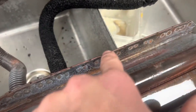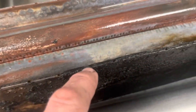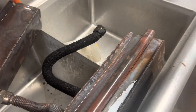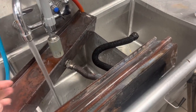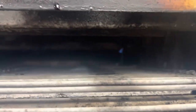Air gets infused — you've got gas coming in the upper rail right here, and then you have the circulation fan that blows the oxygen in to combust. Look — closed, closed, closed, closed, closed, closed. So you're not getting much oxygen pumped into this side, which does explain why they said the right side of this unit does not cook as fast as the left. It's one burner — not a left burner, right burner. We didn't have fire on the upper right-hand side, so I took off the orifices and cleaned them. It was a little gunked up — maybe just wasn't getting enough gas pressure on top.